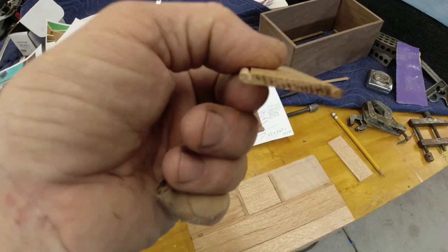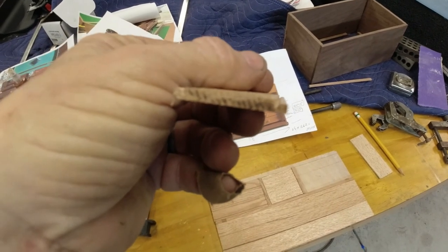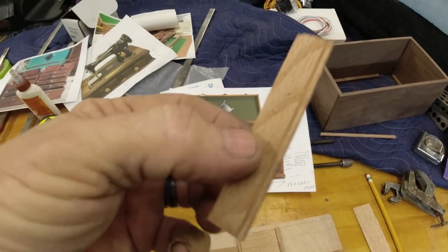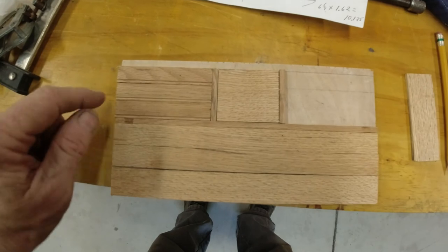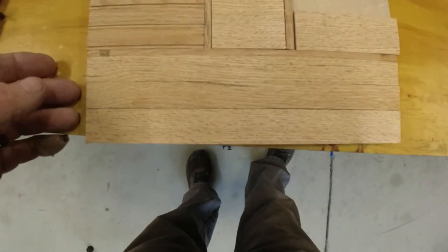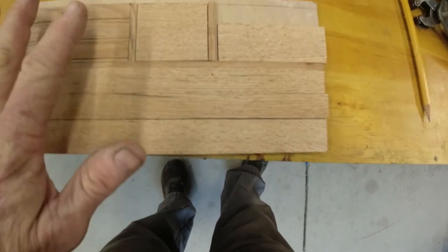This is my practice piece - it only gets a groove on one edge. I grooved both sides of this practice piece trying to get the cut to come out right. Here are the actual drawer fronts - I've started grooving some of them. This is going to be my false front. I've got three little drawers here, a bigger drawer in the center, and then three smaller drawers. If you don't put that groove on there and get these all together, it's kind of hard to tell there's three different drawers, so that groove will help offset them and make them look more factory.